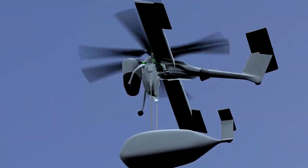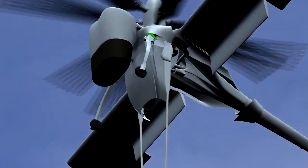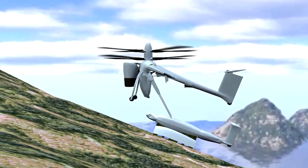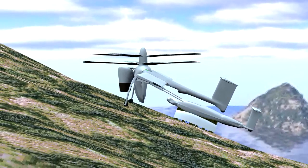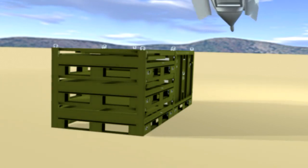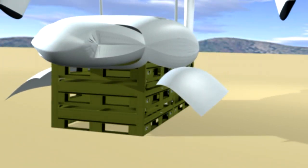Next, the aircraft lands on the side of the mountain while awaiting further operating orders. As shown here, the pivoting tail boom keeps the rotor at the horizon when resting on highly sloped terrain. One final task for this aircraft is to retrograde a stack of empty modular containers. The empty cargo pod sweeps the ground with its tail wheel while being pulled over the stacked containers. As this video indicates, any type of cargo that conforms to the JMIC standard can be transported.